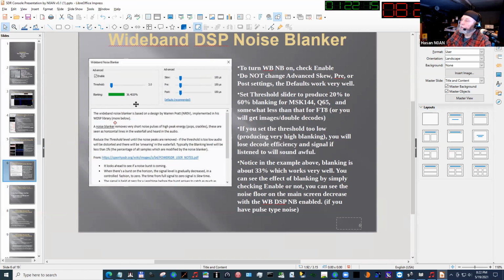Noise blanking is extremely effective on MSK144 and on Q65. On FT8, if you get too aggressive in noise blanking, you will get multiple decodes. You'll get a whole series of decodes from the same station. And it has led people in the past to say, oh, this guy's got a bad signal, look at all those images because he's overdriving his radio. Well, that's not what's happening. You are distorting the input signal with your noise blanker. So be careful before you jump to a conclusion about somebody else's signal. Always look at the noise blanker, and if you have any questions at all, turn it off. If you turn it off and the multiples go away, the problem's on your end, not on their end.